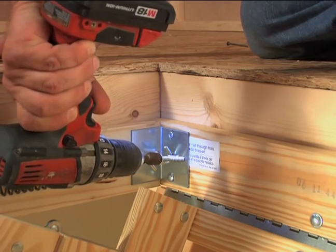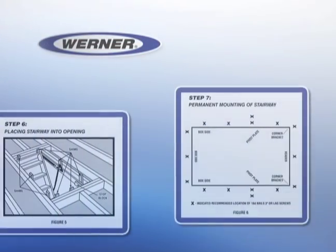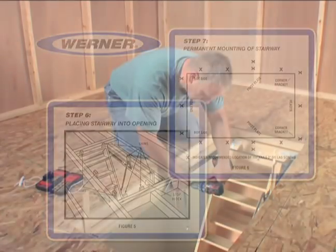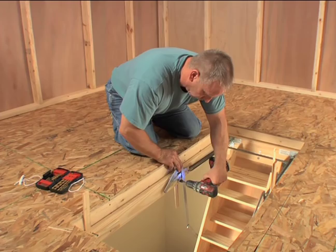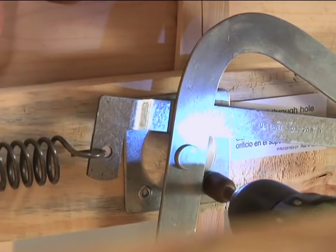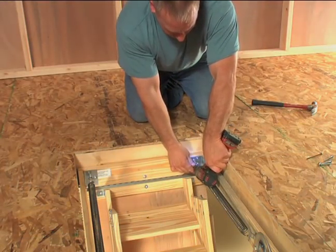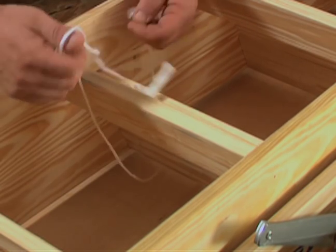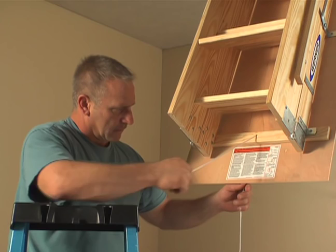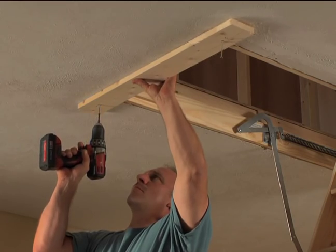Now that the ladder has been properly placed, the next step is to mount it permanently. Make sure the stairway is square and level in the rough opening. Nail the sides, the jams of the stairway frame, to the rough opening frame using 16-penny nails or 3-inch lag screws. Make sure the door closes without interference. Untie the cord and pull the handle that holds the ladder sections together, put the end of the cord through the door and double knot it, then remove the temporary supports.